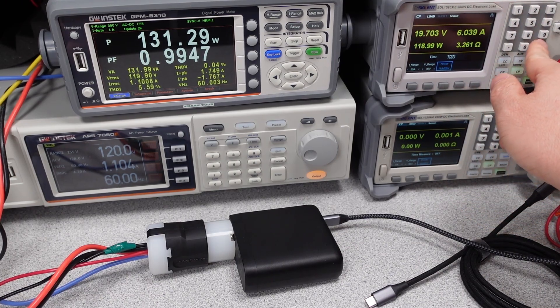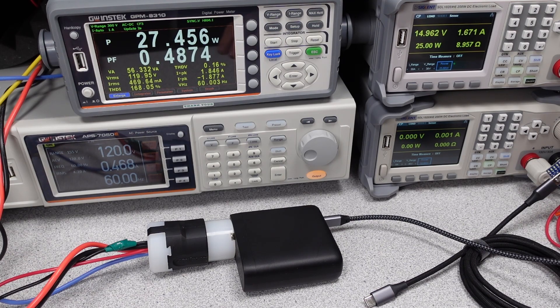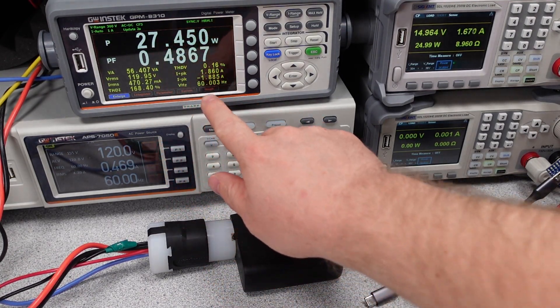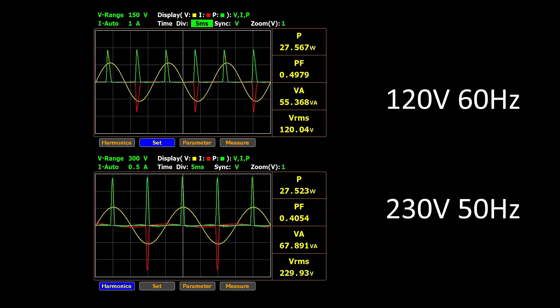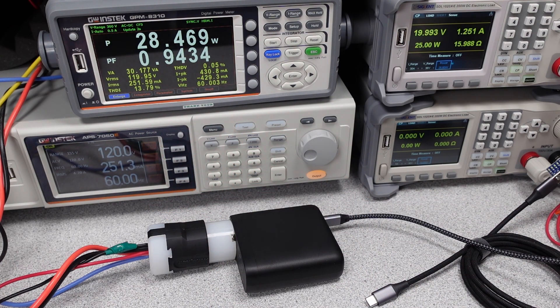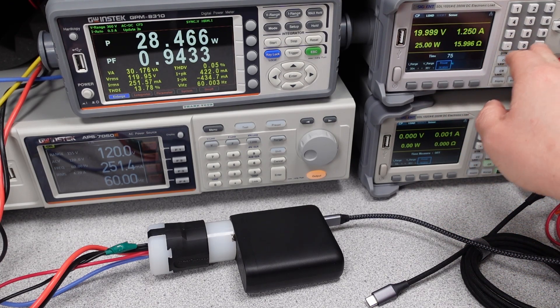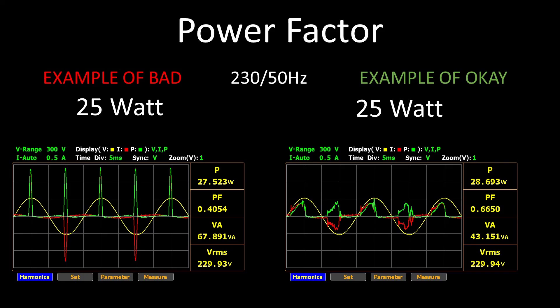The 100-watt adapter tripped on overload at around 120 watts, and it safely recovered. Power factor correction is not present on any of these adapters except the 100-watt one, and that adapter turns PFC on only in the 20-volt mode. On the lower wattage adapters, PFC isn't expected, so they have rather large peaking graphs, not following the sinusoidal shape of the ideal line. Power factor correction is a technique to consume AC power as efficiently as possible — the higher the power factor, the lower the comparable current, and therefore the lower the loss in wires and transformers that supply your power. The 100-watt adapter is pathetic when compared with itself with PFC enabled at the same wattage, but it does lose some real power efficiency. At the higher power levels, thankfully, PFC is on. When switching to 230-volt power, the PFC does make a difference in the graph, but it isn't as effective as on 120 volts, showing the compromise of multi-voltage power supply convenience.